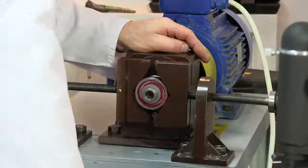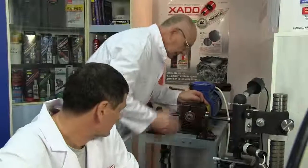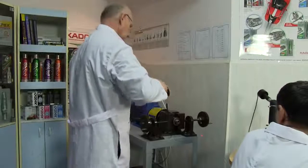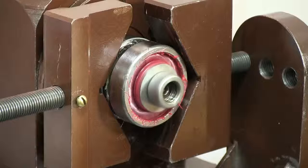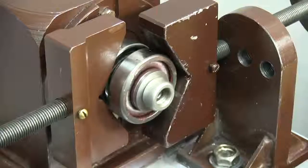During the machine operation, restoration of the bearing takes place. That is, the defect is eliminated by formation of a ceramic metal coating. We constantly control the temperature of the bearings so that they don't overheat. Under the specified load and velocity, the coating can be formed within 8 hours, but we stop our machine after 5 hours, before the end of the treatment.